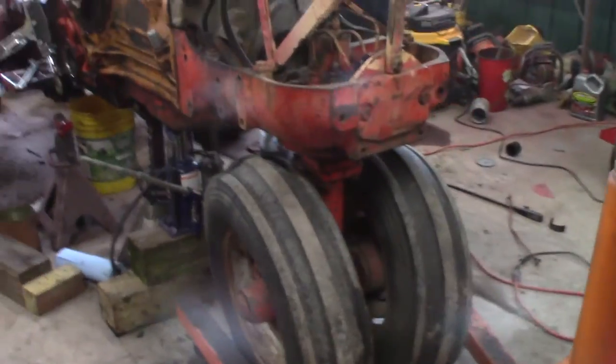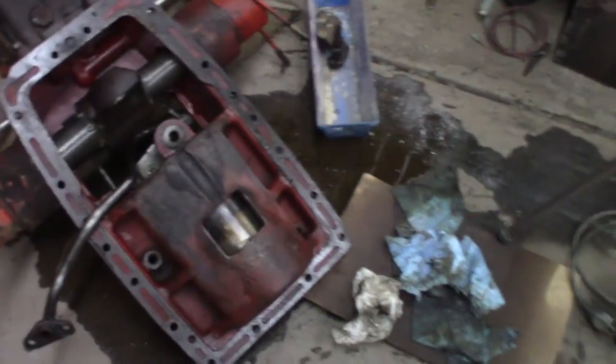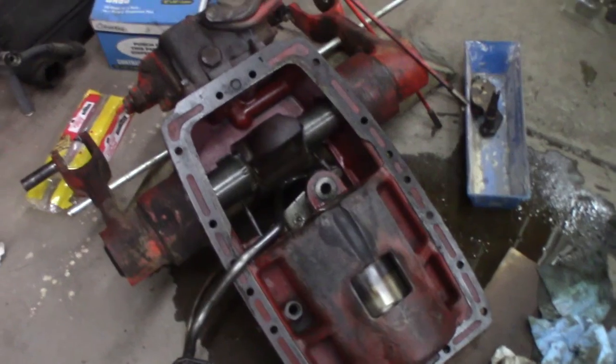The last couple hours went a long way to make it look like a tractor again. At least it's all on its wheels again, so that's good - means we can get rid of the jacks and clean up this area. Not a bad day. Hey guys, we really had a battle with that old bolster today - on and then off again and then on again, we had to do some grinding and some cutting to make it fit. Going from an 830 engine to an 870 engine, there's some differences. There's always going to be something we have to adapt and modify. Thanks for watching - like, subscribe, share, and see you on the next one.